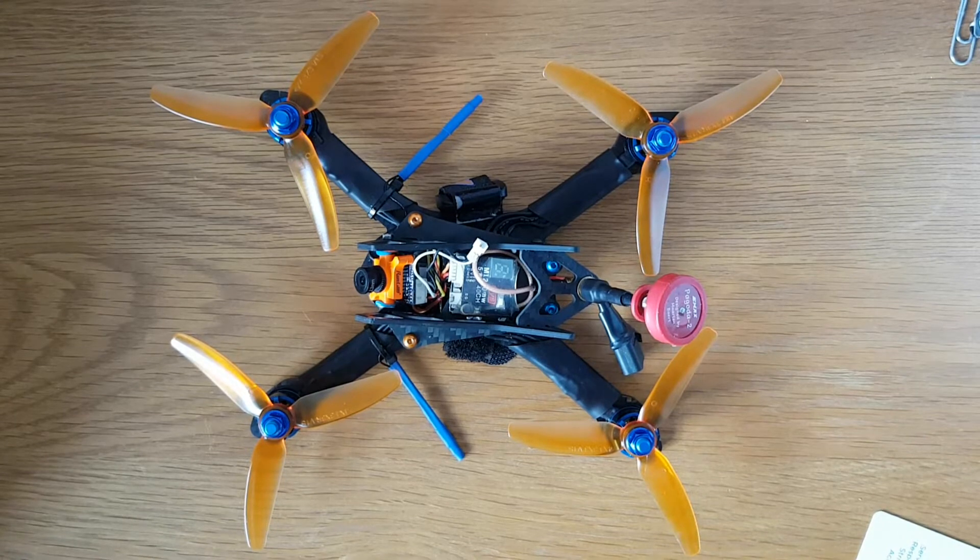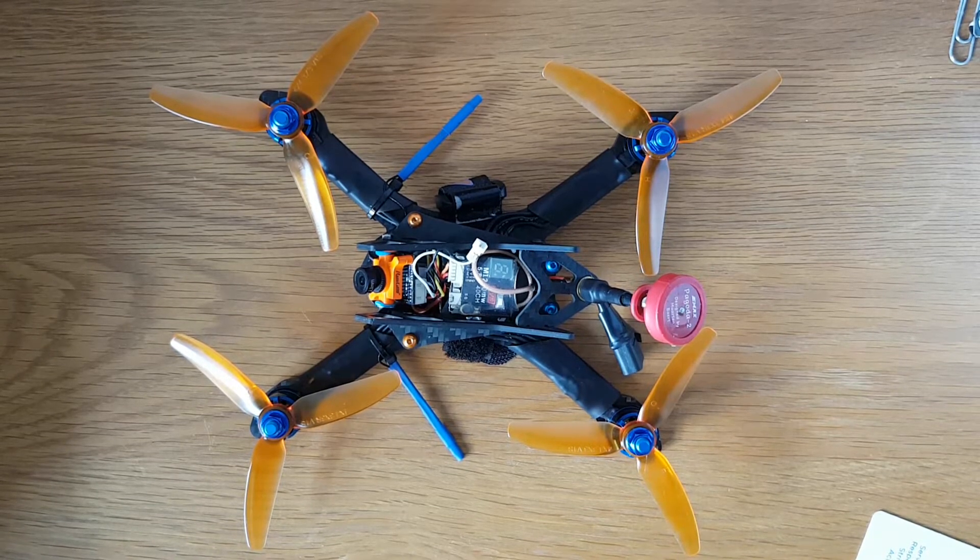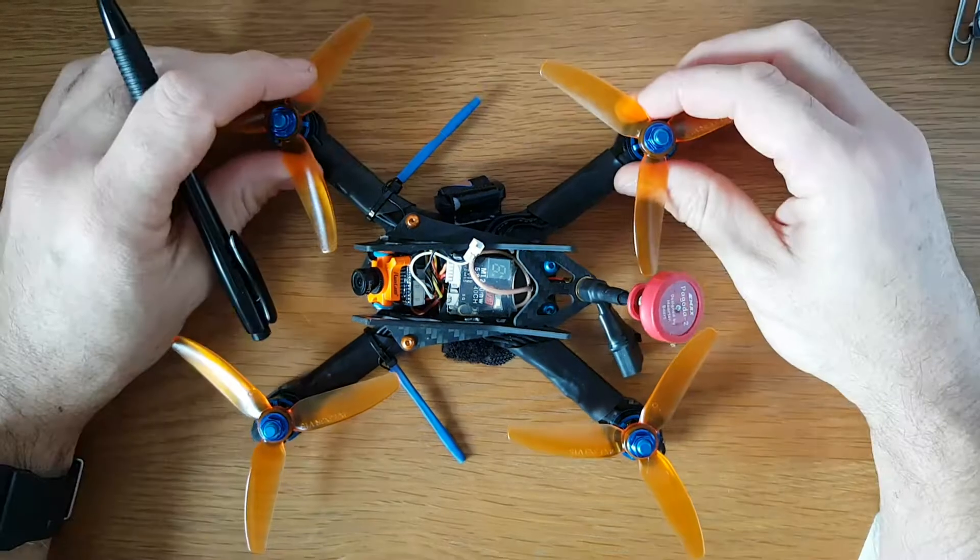Because I was planning to put the Split in, I needed to build a very low stack and use a flight controller with a BEC which could support the VTX, the camera, and the RunCam Split. One issue with the RunCam Split board is it gets quite hot and it's also susceptible to electrical noise — not so much via the input itself, but from the electrical field surrounding ESCs and wiring in general. So if you find you've got interference in your FPV feed using a RunCam Split, it's quite often because on a small build your components are too close together.